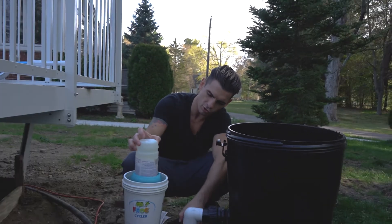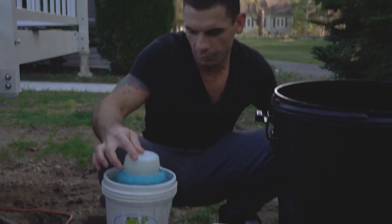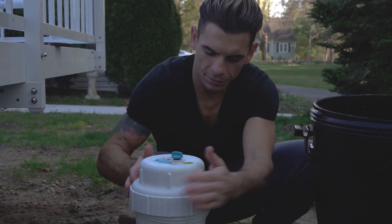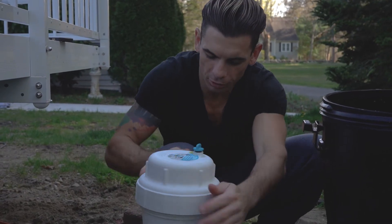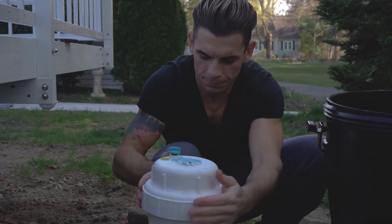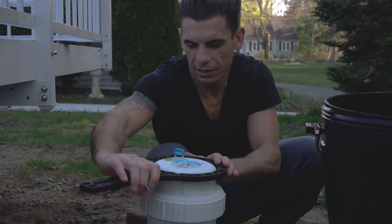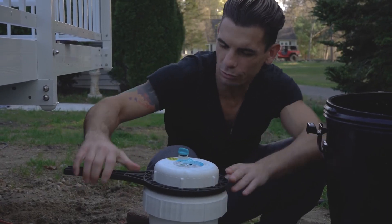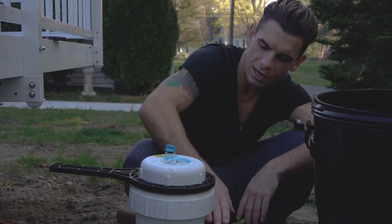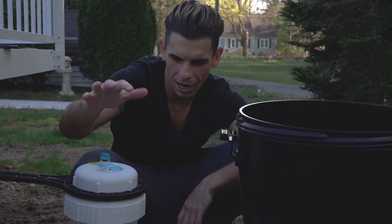Push the chlorine cartridge right back into place — it's okay if a little water spills out. Put the cap back on and make sure it's threaded properly. You don't want to mis-thread these things at all. You'll feel when it's on right. Usually hand tightening is tight enough — just give it a little extra push. Leave this air relief valve open because we want it to fill back up with water before we leave, to make sure the system is primed.